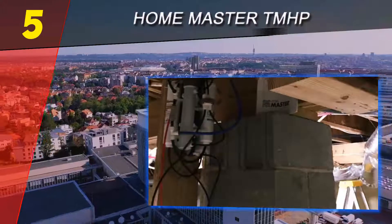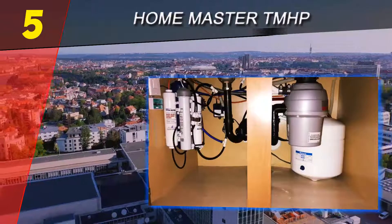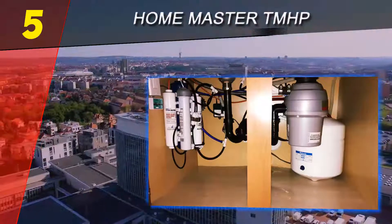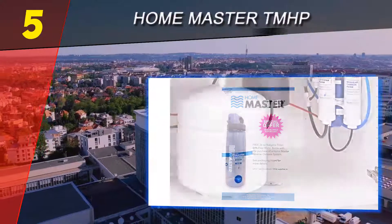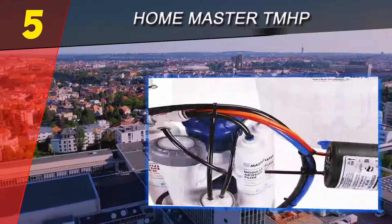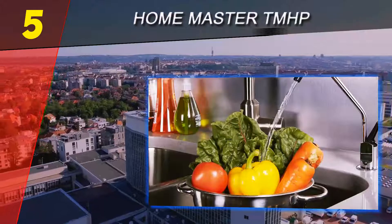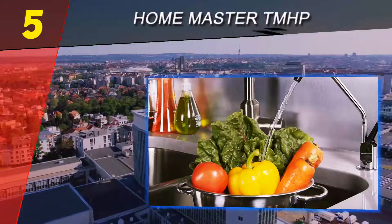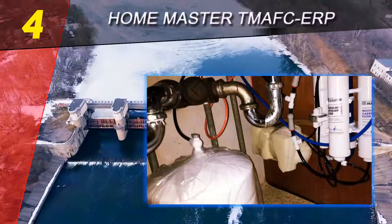The water you get is the closest thing to distilled water in terms of quality. Remineralization is still a feature on this system, with a small amount of calcium and magnesium added at two points — before the water travels to the tank to prevent tank degradation, and before it comes to the faucet to improve taste. The filtered water tastes a lot fresher and sweeter than typical acidic RO water. For more information and pricing, check out the product links in the description.